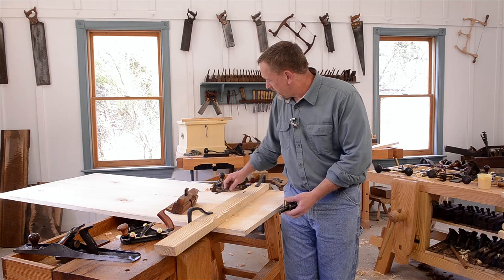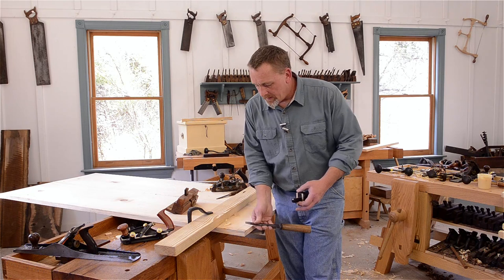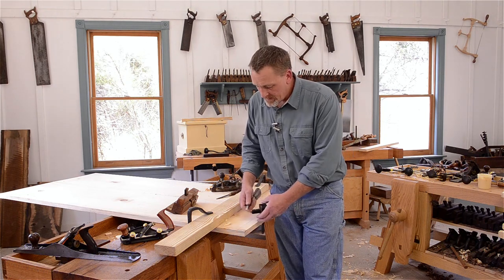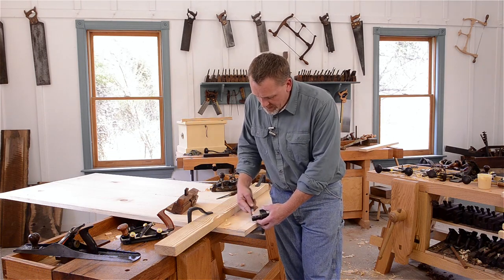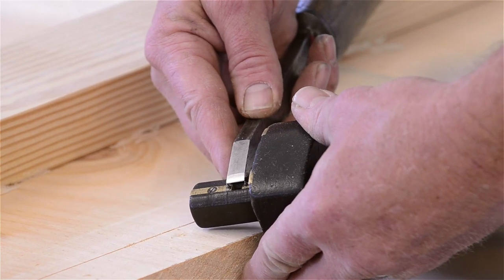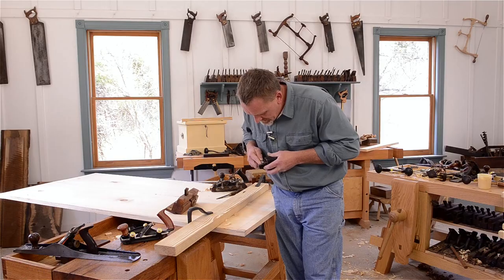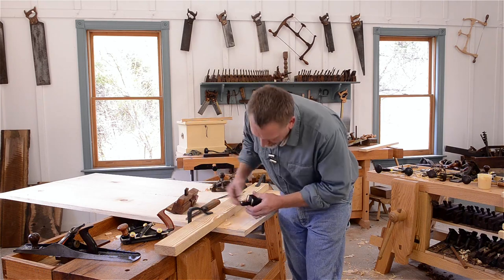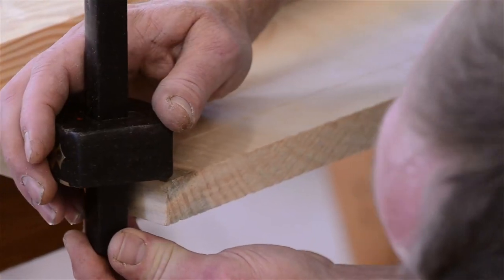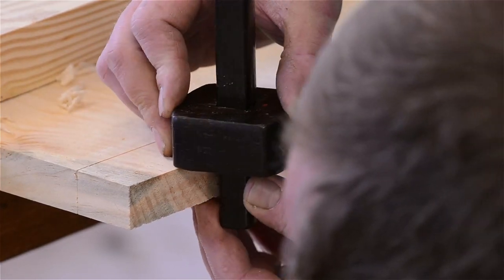And the way we're gonna come up with that is we're gonna be cutting the little mortises for the tenons themselves that will be kind of encased in the breadboard with this 3/8 chisel, same one we used earlier. So I've got the teeth set just right at the width of that chisel. Yeah, we're good. So now I'm just going to center that, where maybe you can see it, roughly. Doesn't have to be perfect.